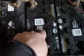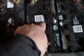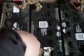so you wouldn't want to discharge it as deeply. So I bought that. I quickly bought this one, which as you can see is the same battery, but it's the D model. That says D there, LM43D, which simply means that the positive and negative terminals are around the other way, which allows for quite a convenient connection here. See? Now these are on opposite sides, so I can just strap real short across there. Then a long strap to another C type, and then a short strap to another D type.